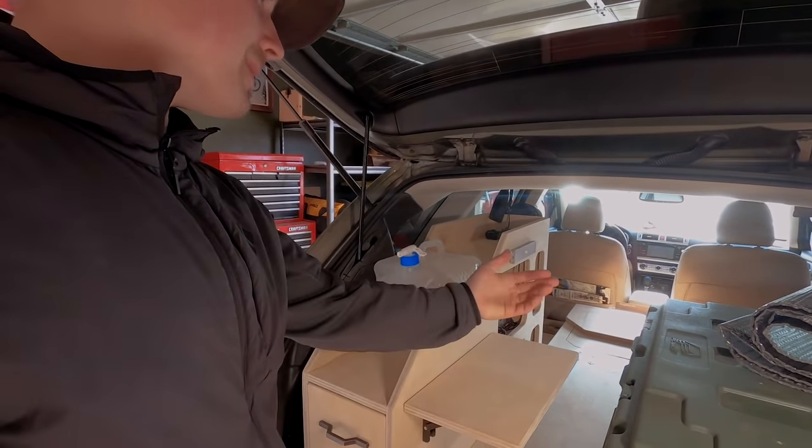And as far as how the bolts secure it in, there's these things called T-nuts, and they look like this. There's a few different styles, but they just sit flush into the wood and act as a nut. So you don't have to connect a nut on the other side of the bolt. You just slide the bolt in, get it started, and then you can wrench it down with an impact wrench or drill or whatever. So that's what I use to secure it. And again, it's just those four different bolts.